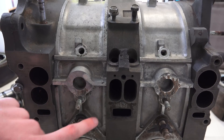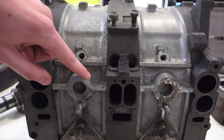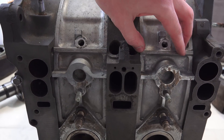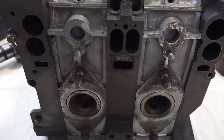Looking on the side of the engine you can see the intake ports. In the center, for the center plate, it's going to divide between the two rotors — this one goes to the rear housing and this one goes to the front housing. Then you've got these two intake ports on either side which will also feed into these rotor housings. As you continue down, you've got the exhaust port — one for each housing.